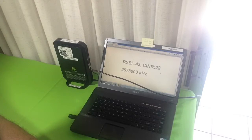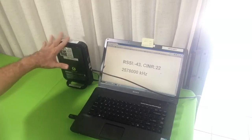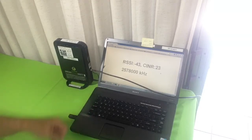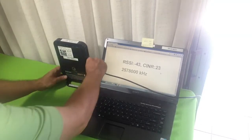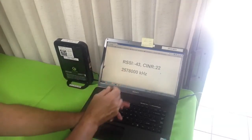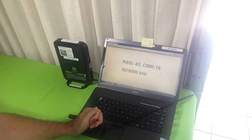Quite a bit of a difference, considering the cable is only five meters long and the antenna is right outside. By the way, this is a glass window — we're looking right out of a window with the modem here. Glass does impede the signal to some degree, and even with the antenna just out there, if we disconnect the antenna, notice it jumps up 20 points on the RSSI and the SINR drops down to 13.